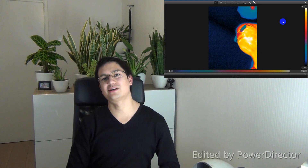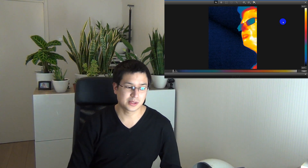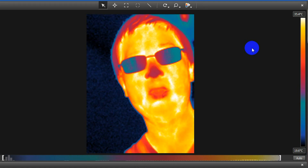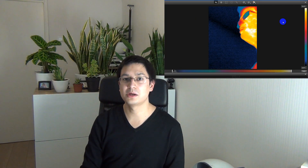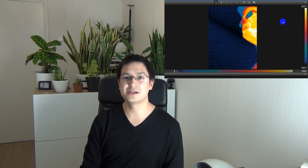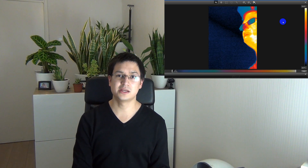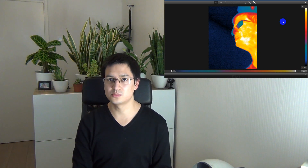In this video episode I'm going to show you three more additional tests for the new Raspberry Pi 2. We're going to test the temperature with my thermal imaging camera so you can see exactly what temperature the Raspberry Pi has when we power it from my power supply unit. Since we are connecting the Raspberry Pi to my power supply unit, we will also be able to measure exactly the current being drawn. During these tests we're going to run some benchmarking, which will show us the maximum power being drawn and also give us more information about the temperature rise of the Raspberry Pi 2.